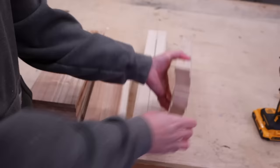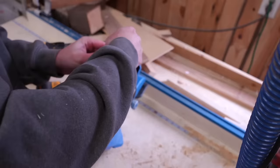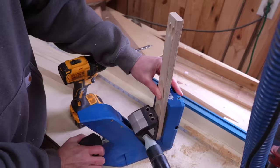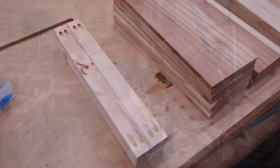That's part B on the cut list, and that part is five-eighths inch thick. Since five-eighths isn't printed on the bit itself you can use the back of the jig to determine the depth, or just eyeball it in between a half inch and three-quarter. I'm using the two closest guides on the far right of the jig to put a couple of pocket holes in each end. With that done for all our crossboards, let's do the same thing for all of our parts E, then we'll move on to designing our legs.